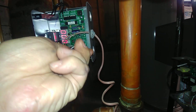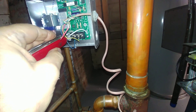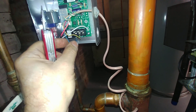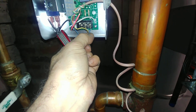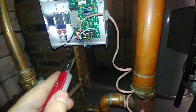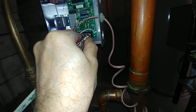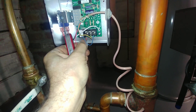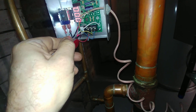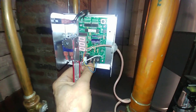What is going on is that this is really the neutral wire and this is what you'd call the hot wire, even though it's only 24 volts. Normally we only pay attention to that on a 120-volt circuit, but they wire this so that one end is ground. We swap it, light it up, and now there's our period — it's now getting a signal.